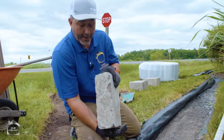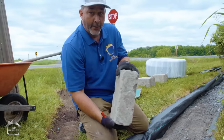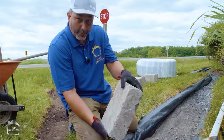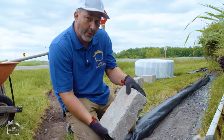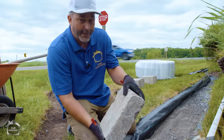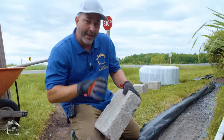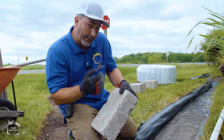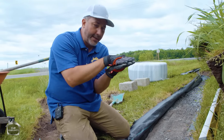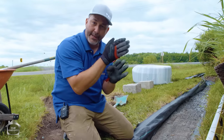There are two kinds of stone: a smooth pour and a rough pour. With the rough pour you can put adhesive to go from layer to layer without any additional work. If you're getting a smooth pour or chiseled stone, you've got to take your quick cut and put lines in it so that when you put your adhesive on, it's got something to grab between the stone layers. If it's totally smooth, the adhesive has nothing to grab onto. You put the marks in there and the glue grips up and down — that's where you get your strength.